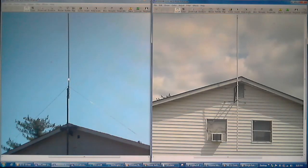So it seems that the antenna that has the radials running east and west picks up better from the east — and I'm assuming the west too. The antenna on my house with the radials running north and south — this one goes south, that one goes north — this one seems to pick up better from the south, so I'm going to assume it would also pick up better from the north. It turns out these antennas are directional — they pick up better from the direction that the ground radials are pointing.